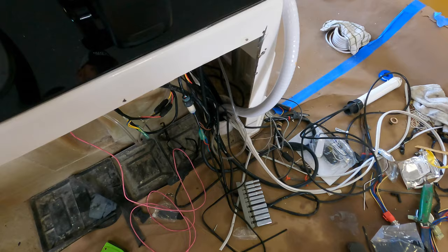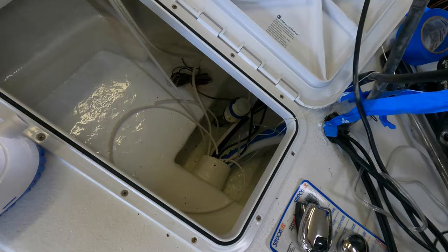So I've got a big 4-inch rigging tube. Everything's coming out of there, comes to the back here. That's what it looks like in there. You want to do a continuous run on everything. You don't want any splices in the middle inside the rigging tube because it gets wet in there. So I did everything as one run, home run shots, all the way to the console, to the back, and that's pretty much it.